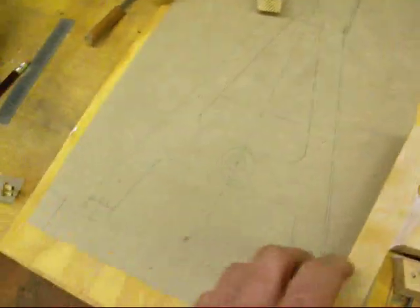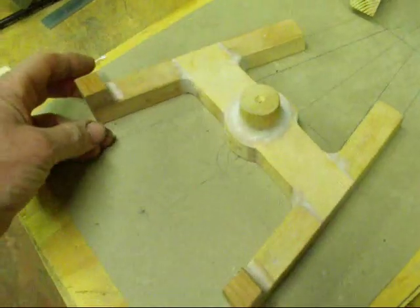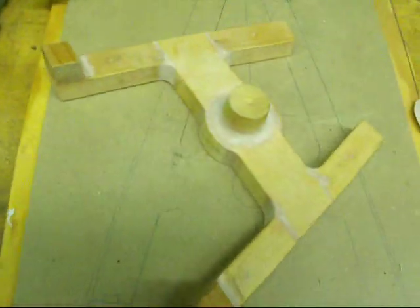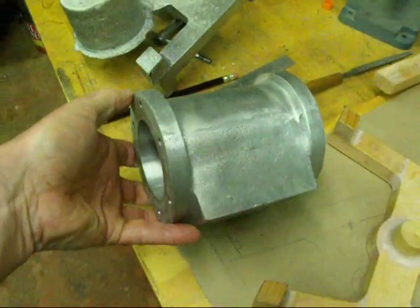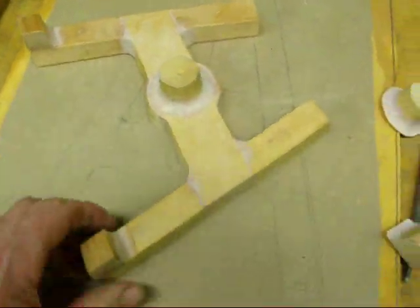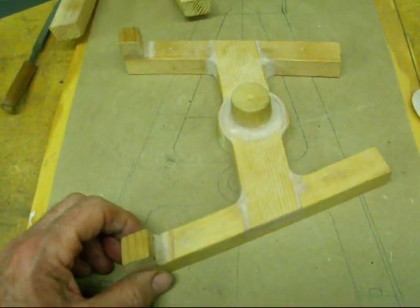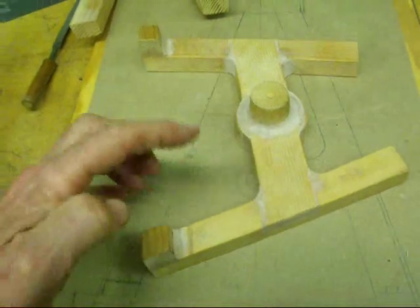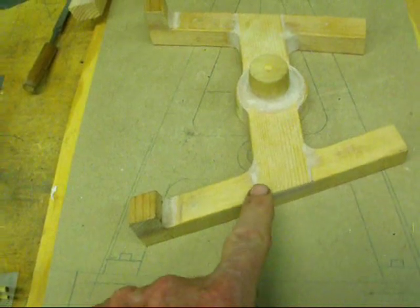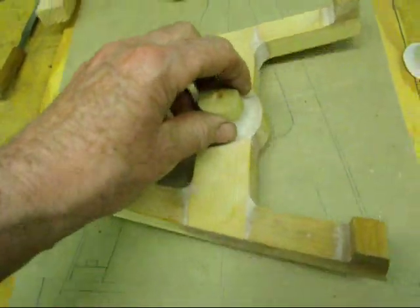The pattern itself — this is a flat back pattern. That is to say it is not a split pattern as some of the patterns I've shown you. Usually when we have a cylinder it's a split pattern. So this is a flat back, meaning all of the casting is poured in the bottom half of the flask. This pattern incorporates a couple of loose pieces. These are all half lap joints here for strength. I put an awful lot of time into this considering I'm only making one casting and one engine.